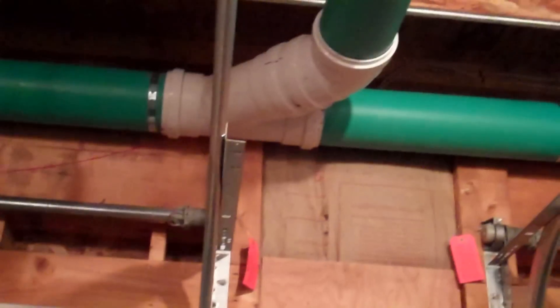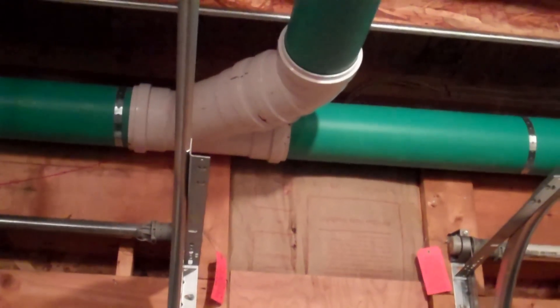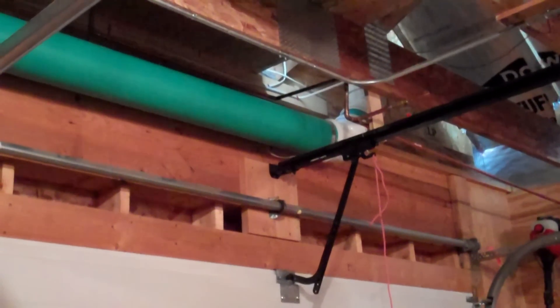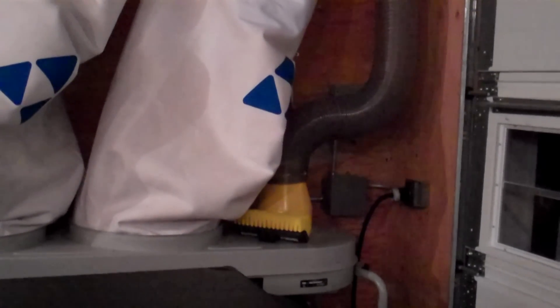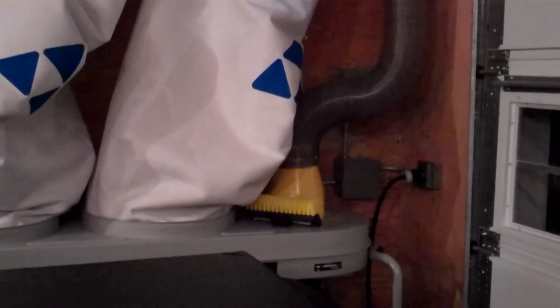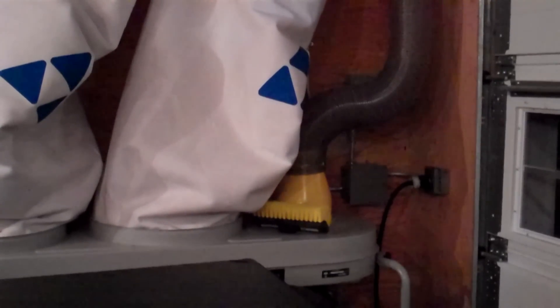It also tees off to another 6-inch line that goes back through the center of the shop to pick up the table saw, and then lastly runs over to the other side of the shop with another 4-inch line that runs down the length of the shop. For all of this piping, I worked pretty closely with Delta and they gave me some pointers on sizing, basically verifying the sizing I had come up with based on my machinery. There are a lot of online resources that tell you how to size the different ducts based on the machines and also the horsepower of the dust collector.